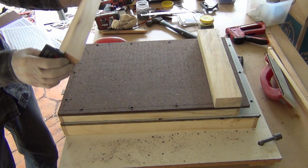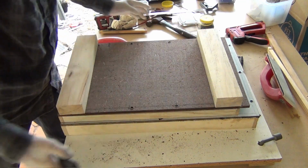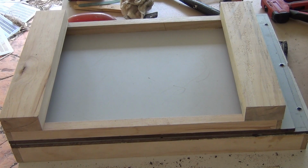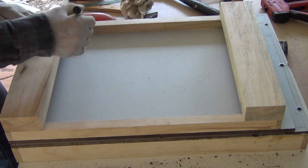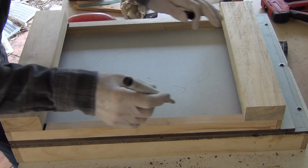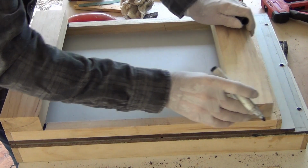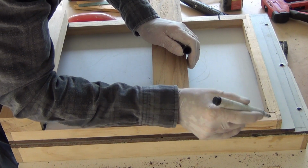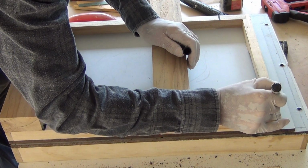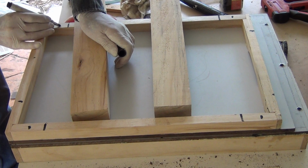You're going to be putting 2 supporting rails on the underside, front and back. I would drill through from the frame side so that you don't actually hit any screws. So just mark up where it goes, where the rails go. Put 1 through the middle there, 2 on the back, 1 on the other side.